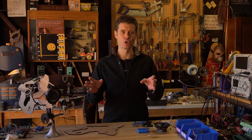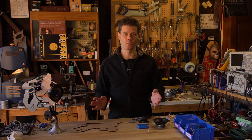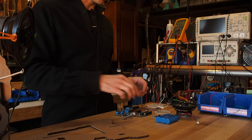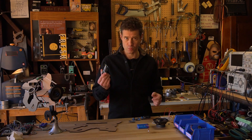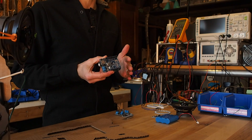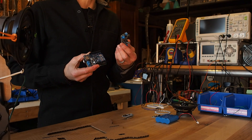In this video we're gonna look at combining those into a single system. Here's some of the parts we used in the initial creation of the subsystems. We have a microcontroller board — we used two of those, one for lights and one for sound. We're gonna combine that into a single board. We also had the background music playing from an MP3 shield, and that was being amplified through a 20 watt amplifier.